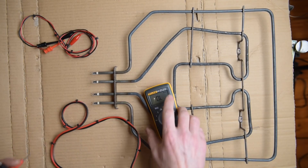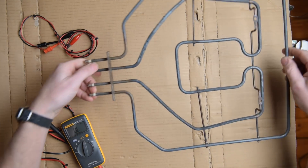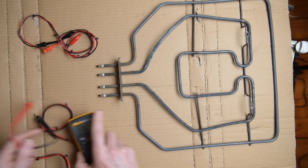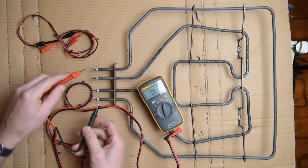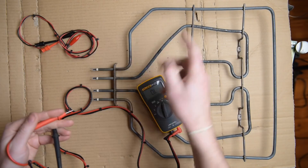Then we test the inner one, and the inner one is showing 21.7. I do remember when I tested this that it actually proved to be open line when I checked it — and it's not surprising, it will be open line. It's pretty much completely knackered there. The outer one is 40. If you ever get a time when you can test something against something else as a reference, always check the other — it's just the easier way of doing it.